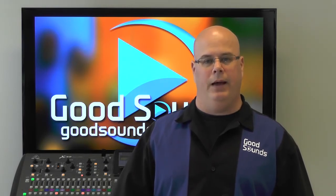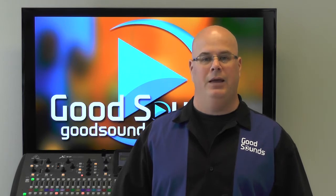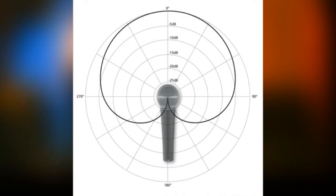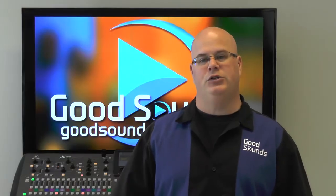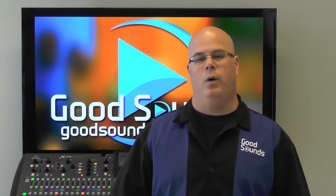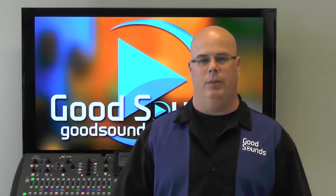Using an earpiece with a cardioid pattern or an omnidirectional pattern is again more of a personal preference. A cardioid pattern is one where the microphone only picks up from one direction and tries to reject sound from the other directions. This microphone can be helpful if you don't have a great setup with a sound system, because it won't be picking up a lot of sound from the surrounding areas like other actors or music. It should allow you to get some more volume before introducing feedback. However, it can tend to give some unwanted color to the actor's voice if it isn't situated properly.